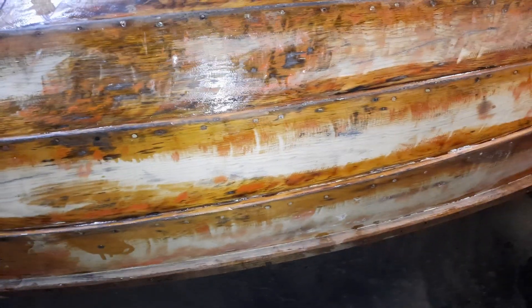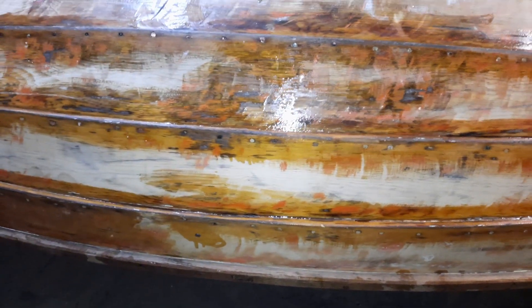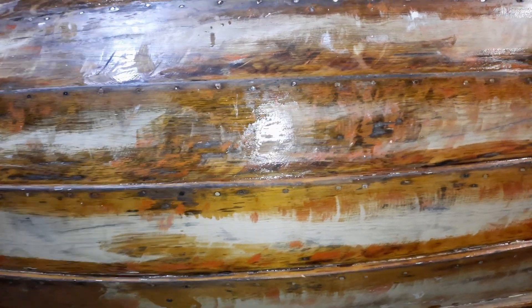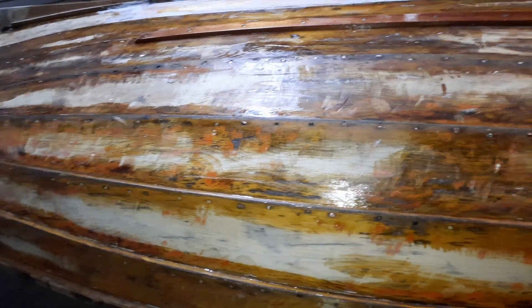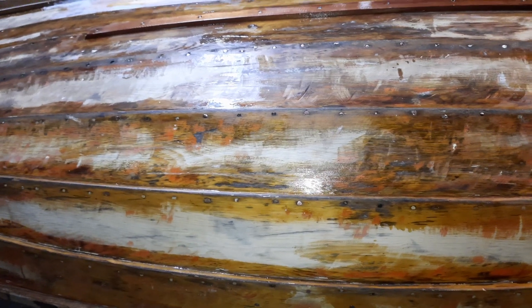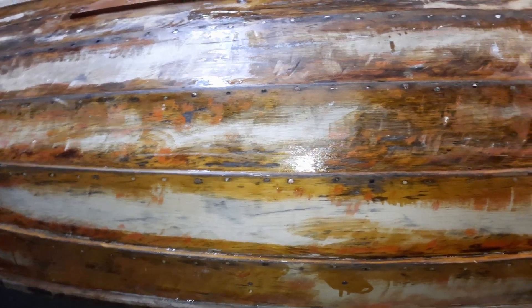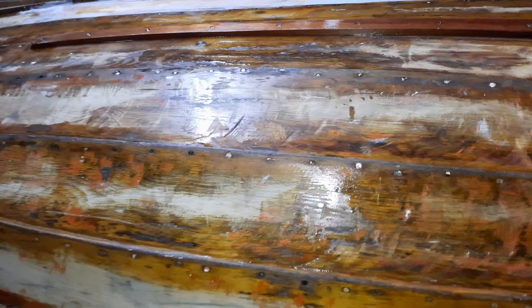Hopefully those ridges will sand out when I go over it with a sander and clean up the putty. If any spots look really deep and bad, I'll pick it up and put some putty in it. There's a possibility I'll have to re-putty bits and pieces — I'll get it all puttied, put some undercoat on, leave it in the sun for a day or more to set, then check it. There'll possibly be a little bit here and there that needs more putty.